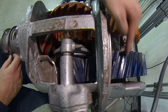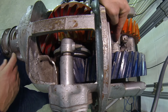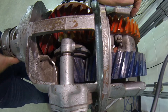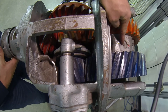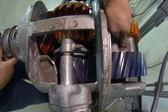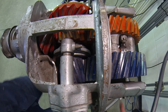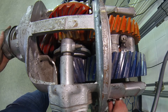Those drive gears drive the driven gears, and between the driven gears is the differential case. Inside the differential case we can see — rotating it so we can see — the end of a cross shaft right there, which supports the differential pinion gears inside, and the axle side gears that are tucked inside the case. Our axles mount in through the side hole here.